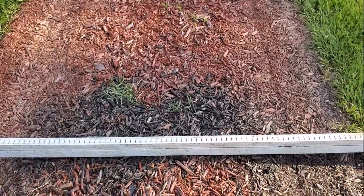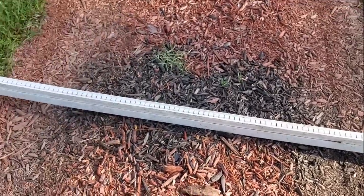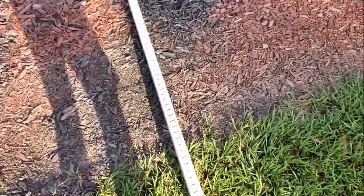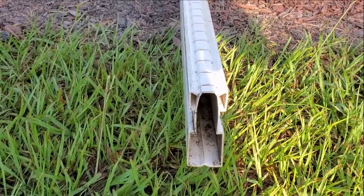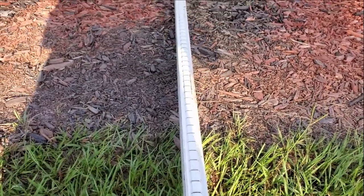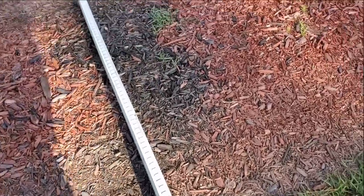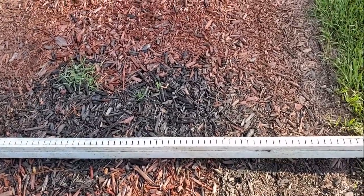This is micro channel drain — the most common channel drain. You'll find this around your pool, around your lanai, maybe just on your pool deck. It's inch-and-a-half pipe with a square grate across the top. There's an insert that holds the sections together — it just slides inside one and slides inside the other. These tend to fill up with dirt because nobody ever maintains them. If you were going to have these in your patio, they take tons of water — they'll handle hurricane-force water — but you've got to maintain the system.